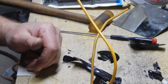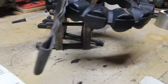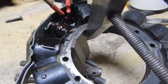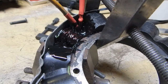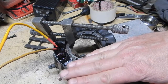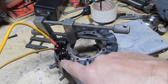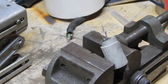I found a strip of sheet lead and molded it into a dam, using machinist clamps to hold it in place - they're also doubling as a little stand to keep it up in the air. I held it up to the light and I don't see any light coming through, so I've got a decent seal now. I'm going to try to pour some more in and top it off. I'm also using my lab jack so I can adjust the height and tilt it back - I don't want it higher on this side, but higher out here, so by tilting it I can flow more in without overflowing the other side.